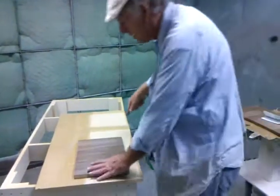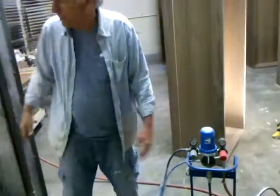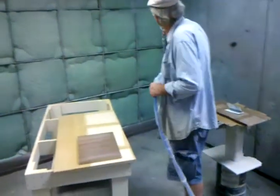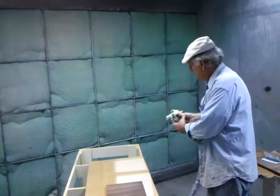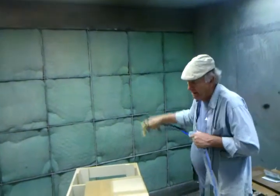Blowing off the air. It operates off air, so you can never tell if it's on — you've got to pull the trigger. This is the Kremlin air-assisted airless that we demonstrated the other day. I'm going to turn it down a little bit — the fan is a little bit large — and get it smaller.